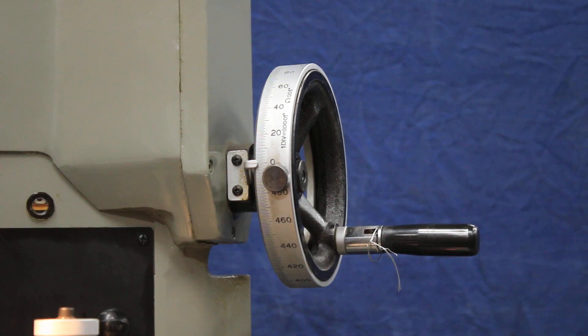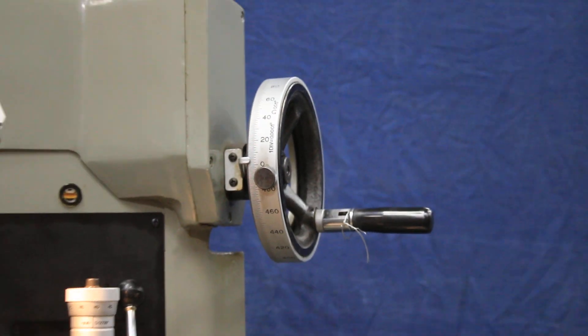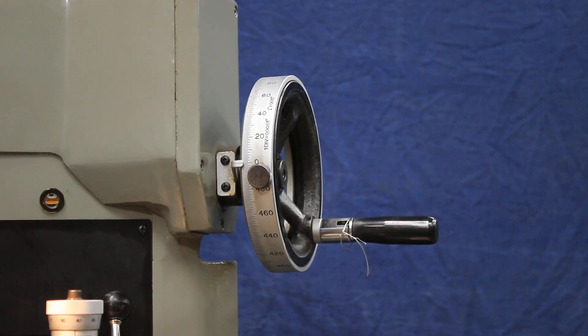If I wanted to select to feed on both sides of the workpiece — which is an awful lot of grinding pressure, that's why they give you the choice. Now you'll see that we're going to feed on both sides. And that's all the fine feed at the end there and the spark out. So that's what you have for plunge.